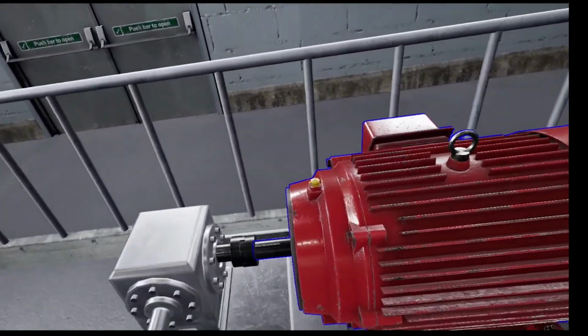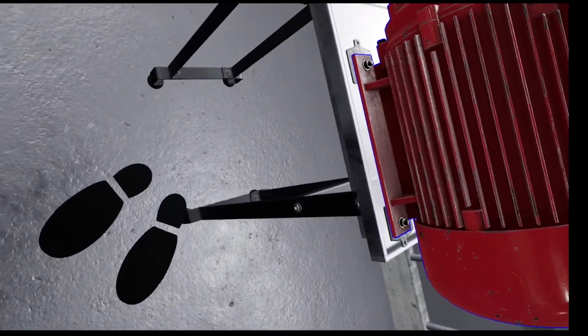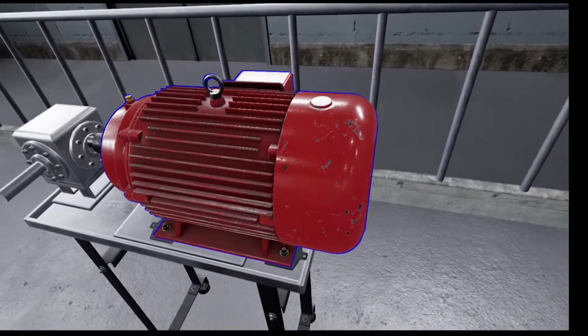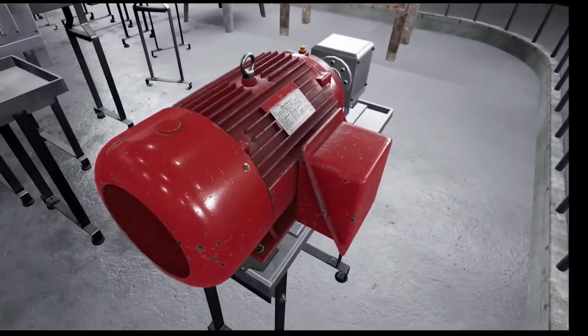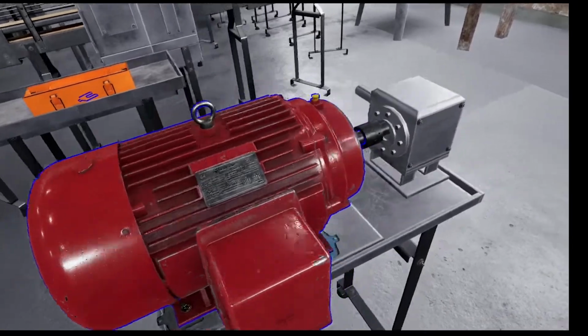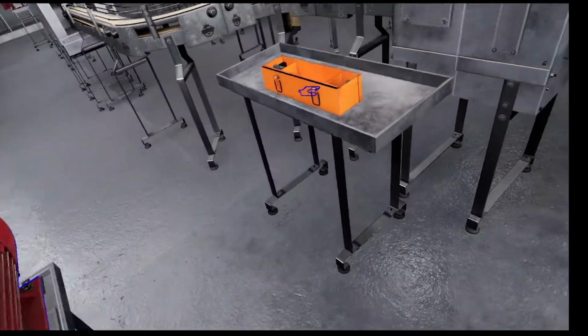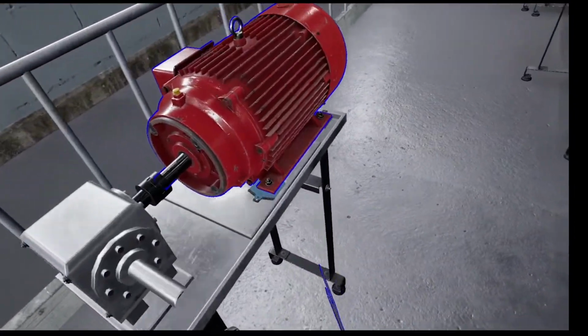Inspect the bottom of the motor against the base plate. The base along the whole bottom of the motor needs to touch the entire base plate of our production machine. Do you notice any gaps between the motor and the base plate? Put your shims under both corners to bring them up to ensure that the motor is resting only on the feet and not in the center of the motor.